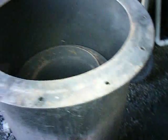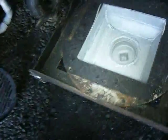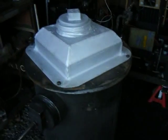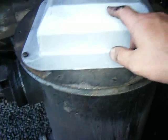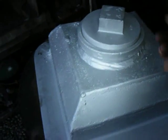The base of the gasifier used to be just a flat steel disc. What I've done since discovering this problem is install a hole in it, and I've made up this little piece here. That's the new base of the gasifier. What it does is increase the distance from the base of the gasifier to the grate, and also improve the ability to clean it out — we can now simply unscrew that and agitate it from below to dump out the charcoal.